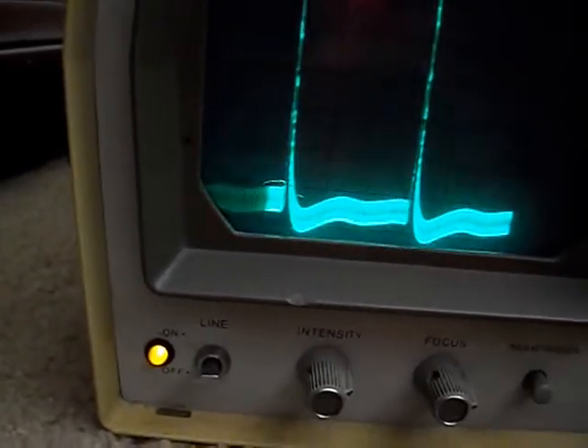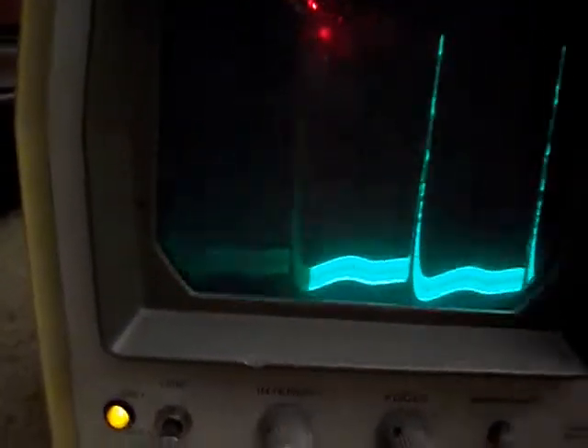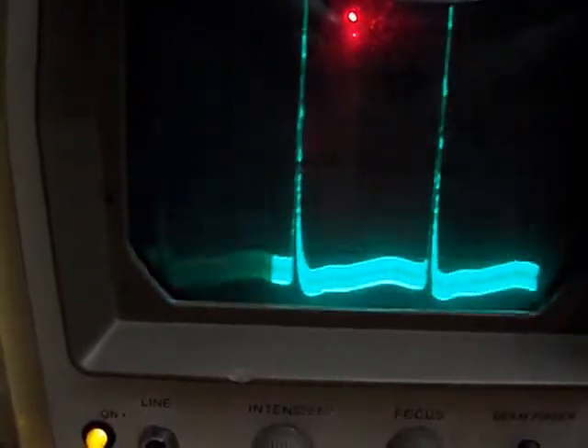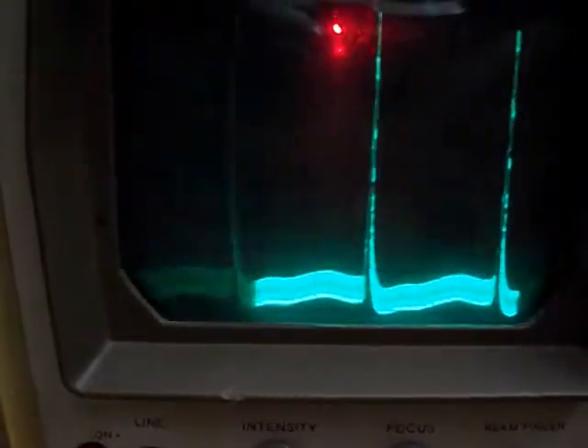I'm reducing it back to the vertical rate. I'm going to take some readings of the sync separator voltages. I'm doing this for another member on YouTube who's having some problems with the same chassis — hopefully he can duplicate what I'm doing here and try to isolate his problem. I'm going to get the multimeter out and check the voltages in and around the sync separator, done with no signal, because that's the way Sam's says it. With the multimeter you don't want a signal; with the scope you do because you have to see the information.